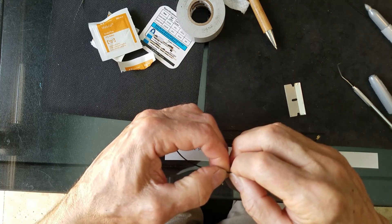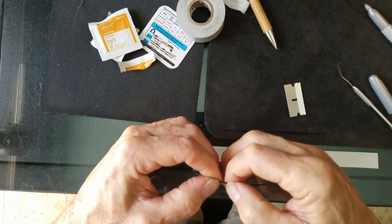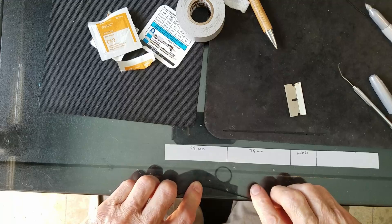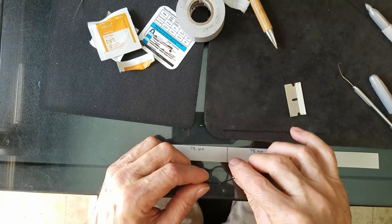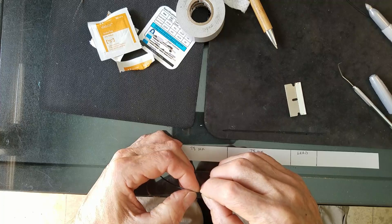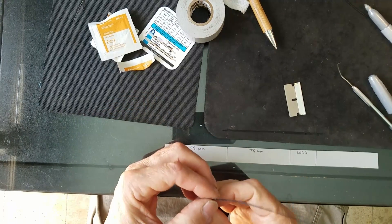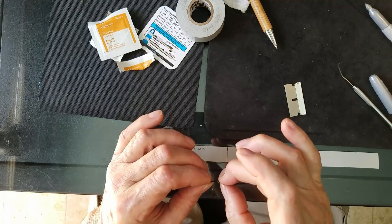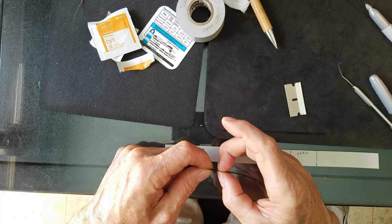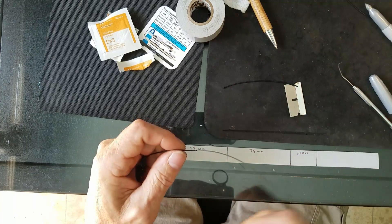Expose the ground shield below the cut — try not to screw it up at all, as this is critical. If there's a little bit of vinyl coating hanging on, massage it back and forth with your thumb to break it. Once you've got a nice clean break all the way around without damaging the ground shield, hold on to the U.FL connector inside and just pull the vinyl off — it should slide right off.